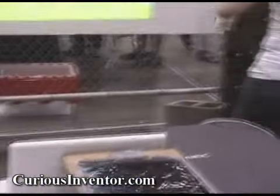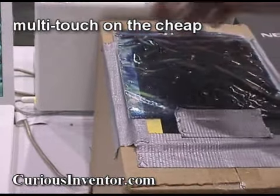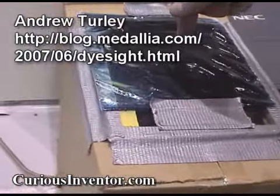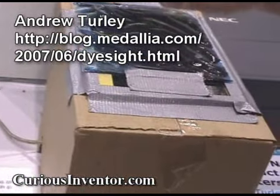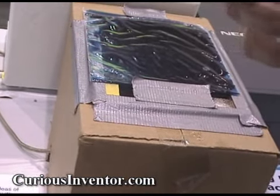How do you play it? This is a multi-touch sensor. It picks up where you're touching. Right now, it just feeds that data in through a PD patch and plays music. There's a webcam under here. It looks up, and when it sees blue, it assumes nobody's touching anything. When you touch it, it detects it as a reddish yellow. So you just look for those and pick out the centers.